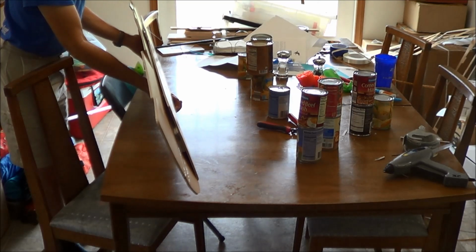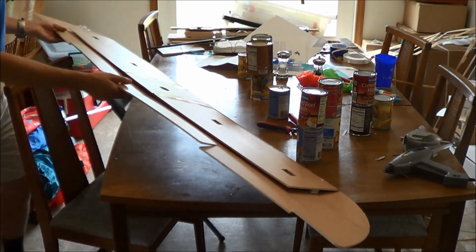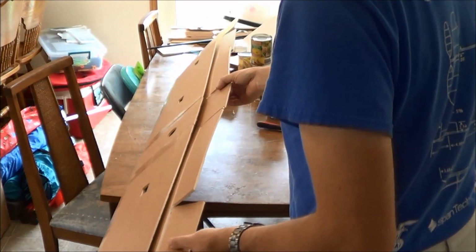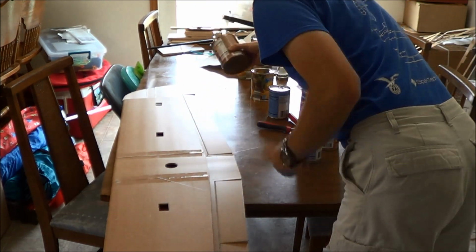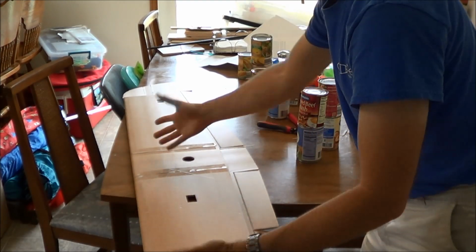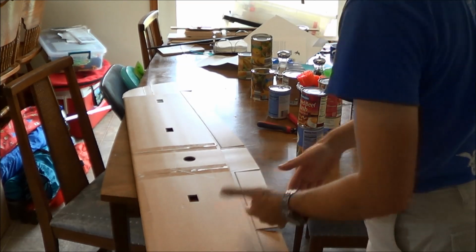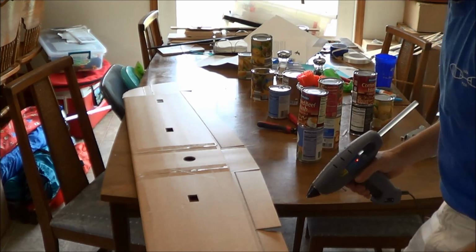This wing is going to flex some under load, just because of the amount of load that we're going to be placing on it. But now, all we have to do is close up the trailing edge, and so we'll get a secondary torsion box in here. So we've got the front kind of boxed out, per any good flight test configured airplane, wing, whatever you want to call it.